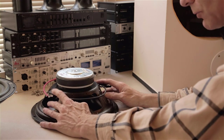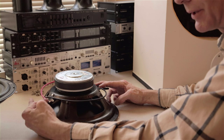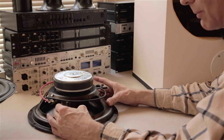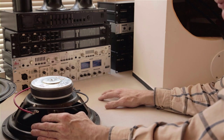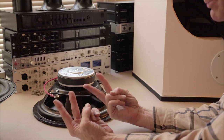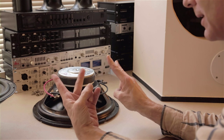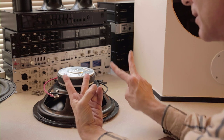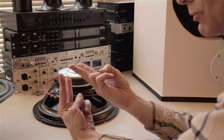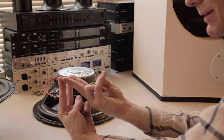The idea of a dual voice coil is to have a stereo bass amplifier with right and left channels, and you wire the right channel to one voice coil and the left channel to the other. I'm going to use this as one channel and have another one for the right channel, so I've got to wire those voice coils together. You can parallel wire them: plus to plus, minus to minus. Be sure not to get polarity mixed up — reverse polarity will just cancel each other out.